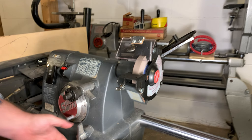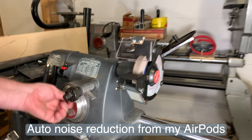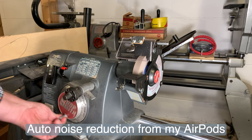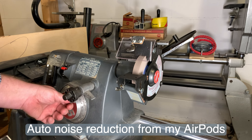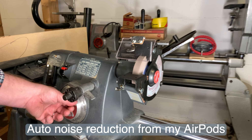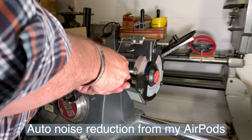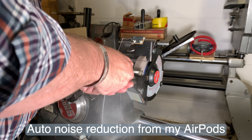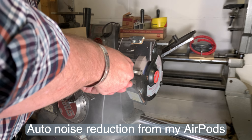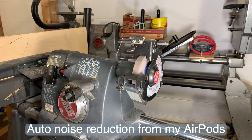So I've introduced a little bit of wobble. It has become my practice to put this in a bench vise — you've got a couple of flats on the arbor — and before I tighten this up, I'll just sort of center the stone. Is it going to be perfect? Probably not, but I think I'm getting it centered better than if I just have it hanging on the end of the quill. I'd love to get your input on that.